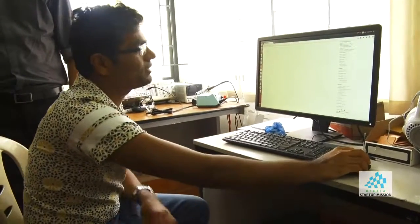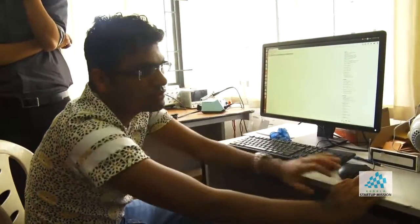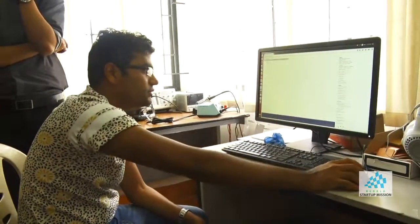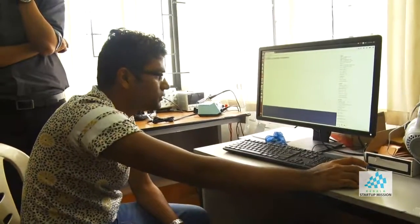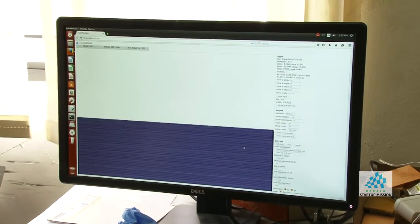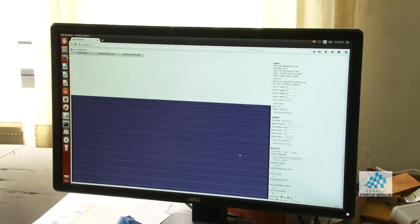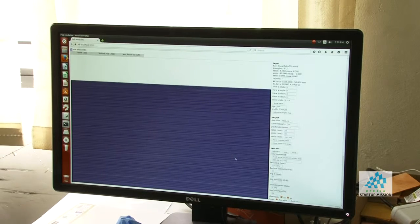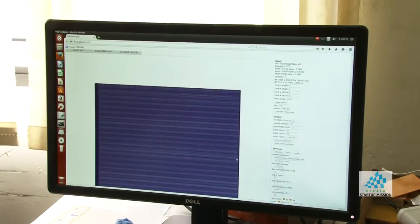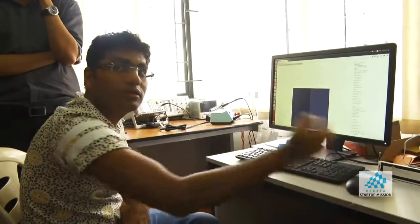Yeah, so if you use the right file, then it shows you something here, and then what you do is you just attach your wax in that base, and then hit send. Oh, I think it's doing it. So the reason it's taking so much time is because it's a big file, and it has to do all the processing. And then just send command, and it's going to mill it.